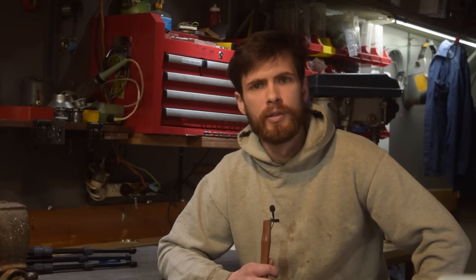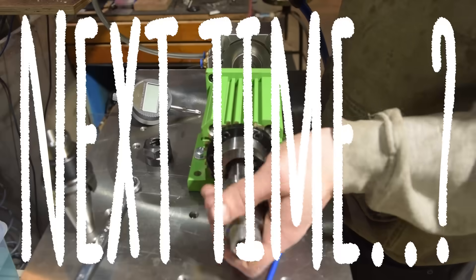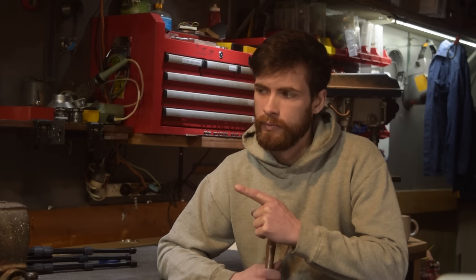There are definitely some things that can be improved here, and first on the list is a new spindle. As you saw, the high-speed spindle does really well in soft materials like aluminium, but when it comes to steel, it doesn't stand a chance. And frankly, the cutting noise of a 6mm endmill spinning at 24,000rpm is uncivilised — just ask my neighbours. Thanks for watching. If you've got any ideas on what I should make on this thing, let me know in the comments. If you haven't seen the build video, it's right here. And if you subscribe, I'll know you'll want to see more.